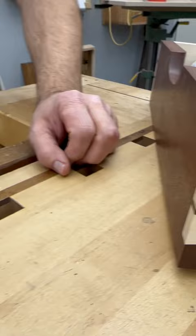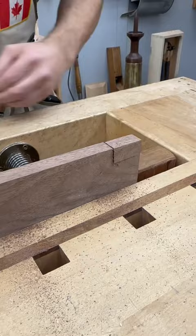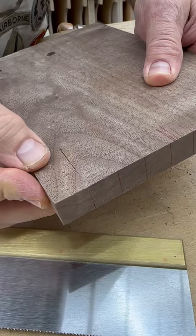Make a cut with your dovetail saw. Go as deep as the saw will allow, then cut that piece off. What you're looking for is a beautifully smooth, flat surface. If your saw is good, when you go to put those two pieces back together, the joint should disappear.